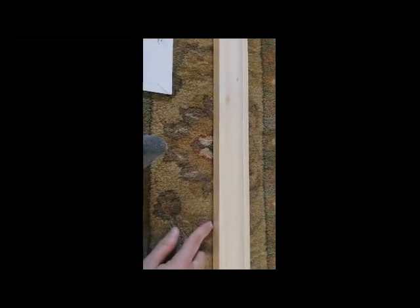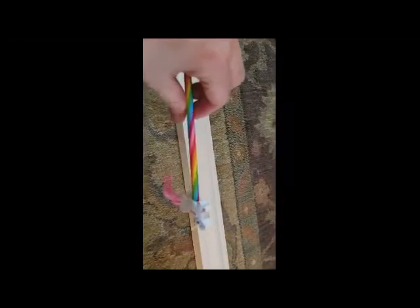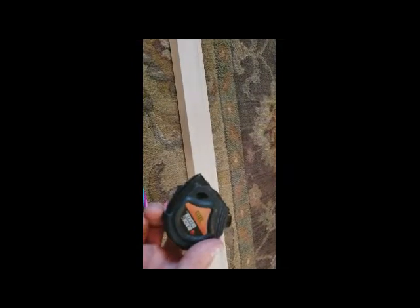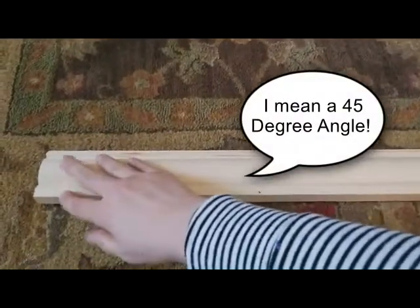I have my measurements and now it's time to measure and mark my board. On these frames, the thicker side is usually going to be the exterior and the thinner side is usually going to go into the interior — so this will be the outside and this will be the part that touches the mirror. I'm going to mark my board carefully with pencil, because that will give me the ability to mark it without digging deep into the wood and creating any blemish. I'll be using a regular Black & Decker measuring tape to figure out my exact coordinates. Before I can measure, I need to get my edge right, so I'm going to create a 90-degree angle at the very tip of this board.